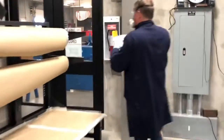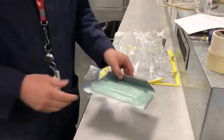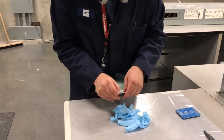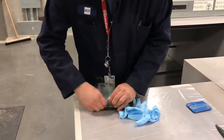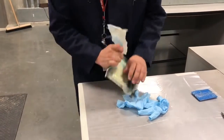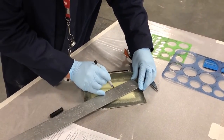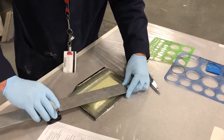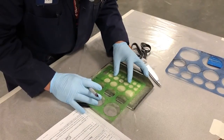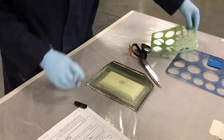Put your name on the bag and it's off to the freezer. We're going to pull it out of the vacuum bag again, putting the lid down to make sure it doesn't get damaged, and very carefully peel off the outer layer of perforated ply and breather bleeder. Now we're going to find center on our sandwich. Notice how I only made a small little X — don't make big lines because those are just things we'll have to grind off. We don't want any black lines showing on our finished product.